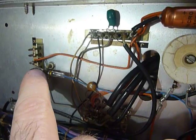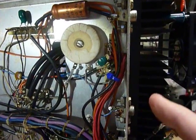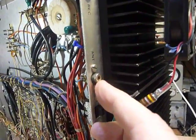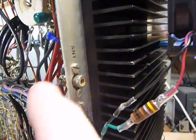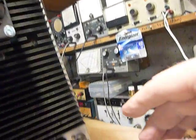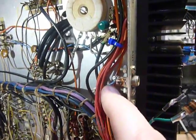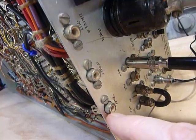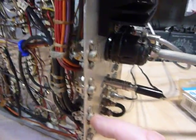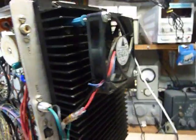A 15-ohm half-watt resistor works well, but you could use a 10-ohm or 22-ohm — just a small half-watt resistor with low resistance that'll blow if there's a short. This radio was modified by a previous owner; the original antenna jack wasn't being used since they added an SO-239 connector up top. So I used that original jack as my 12-volt output terminal, running the fan wire through it, rather than stringing a longer wire to the spare terminal.